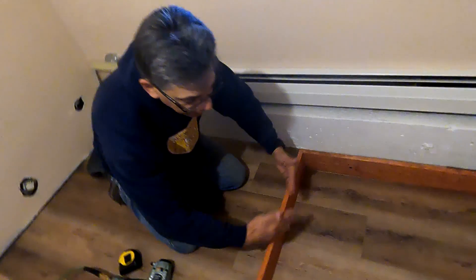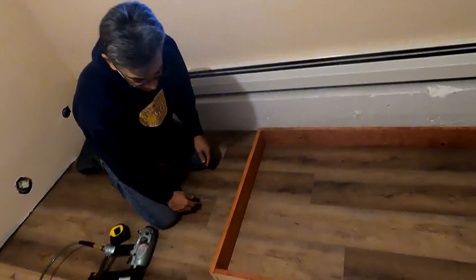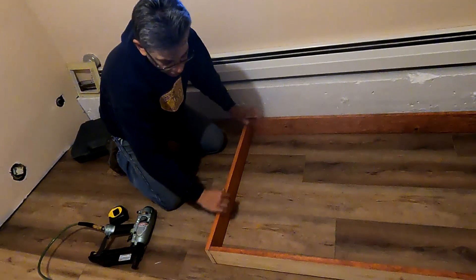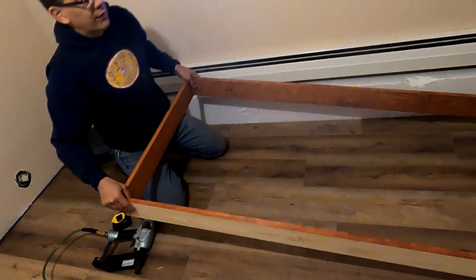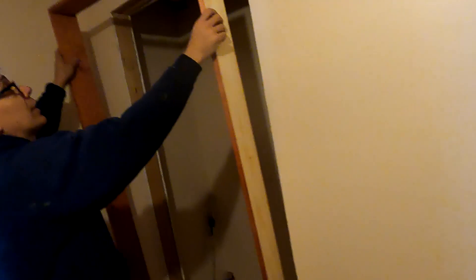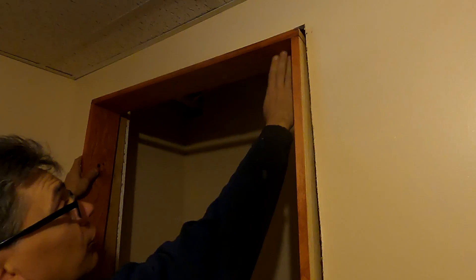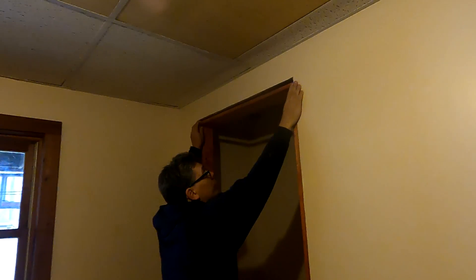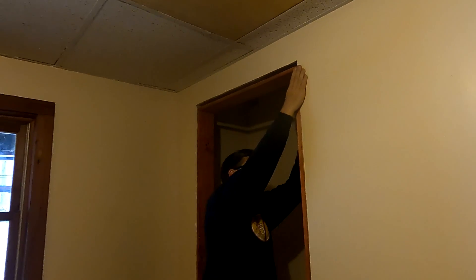Why didn't I worry about square this way? We don't have any bracing in the corners, so these will just be able to flex a bit back and forth. You want it that way for the install — when we put it up, now is when we're going to use a square to square it up and level up. We'll have to kind of push one side in and pull that out. So I've got to switch to longer nails, get some shim spacers, and some squares and levels.